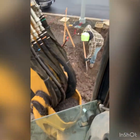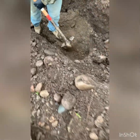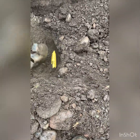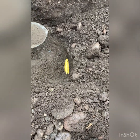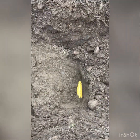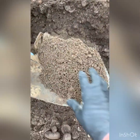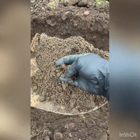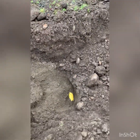Sandy. Let's get out and take a look at it. Find out exactly where this is so we can refrain from hitting it. Oh, there she is. There's a mainline gas. Real fine sand. Oftentimes it's black sand, but this will work. We know what to look for. Look for change in soil, look for sand, a little trench line.